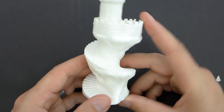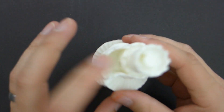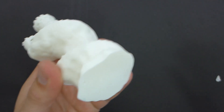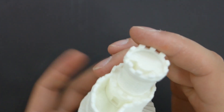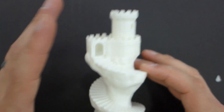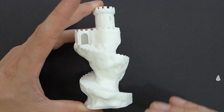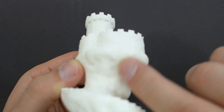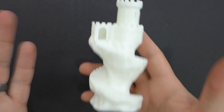I went back to the Ender with the filament and printed this wee little tower — it's kind of going up a mountain with a spiral staircase all the way around, a little courtyard, steps going down, and it's hollow up inside. The first layer stuck really well to the blue tack on the printer. All these little pieces came out really nice — cooling was great, retraction was great, extrusions were great. It took about 12 hours. I slowed it down a smidge to get more fine detail at a 0.15mm layer height. Super smooth on the mountains. I used a better profile so it turned out much better. Now I want to scale this up and print it huge.